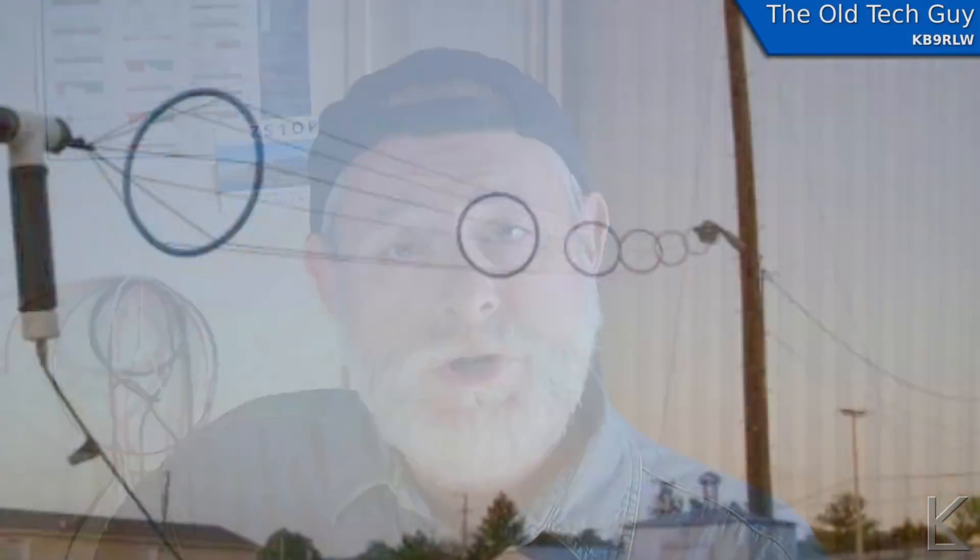That's one of the advantages of a cage dipole, where they use six or eight wires with circular discs to keep them separated, creating a big structure with very broad bandwidth. What I decided to use — and I have a lot of still from past experiments — is good old window line. With window line you've got two conductors rigidly separated so their distance stays the same. If you short both ends together so they act as a single element, it's fatter and you should get broader bandwidth. And it can easily be mounted on the side of PVC.